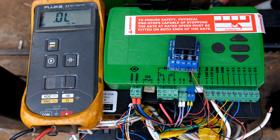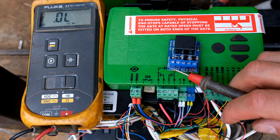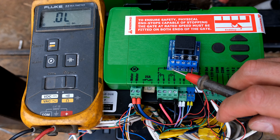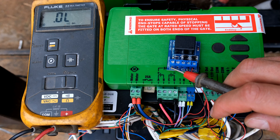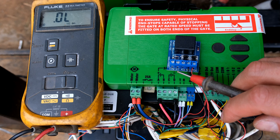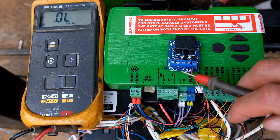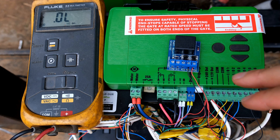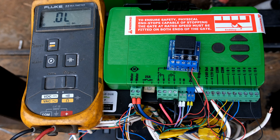On your alarm panel you can set that as a zone, because most alarms work on a normally closed signal - meaning the zone is not violated - but the minute the zone becomes violated it becomes an open circuit. All you need to do is connect the wires to your zone. If you want to connect this to zone 10, you connect one wire from zone 10 to there and the other wire through your series resistor to the normally closed position.